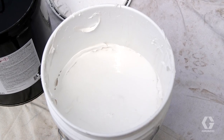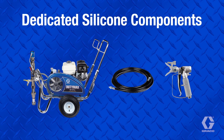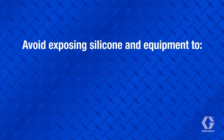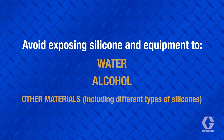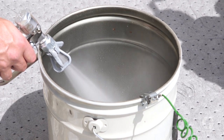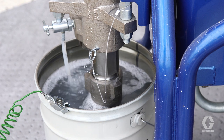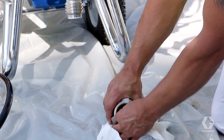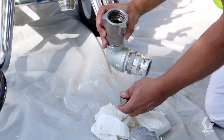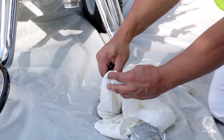There are several things you can do to help eliminate material contamination. First, have a pump, lower hose, and gun dedicated to silicone only — don't use these parts with any other materials. Exposure to water, alcohol, and other materials can cause silicone to set up and ruin components. Flush your machine with virgin mineral spirits before and after every use, as it contains no water or alcohol. Before and after each use, always open the foot valve and inspect for dried materials and other debris that may degrade performance. Clean these components with virgin mineral spirits.